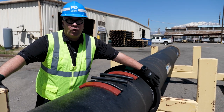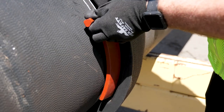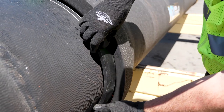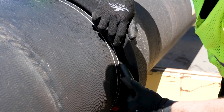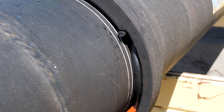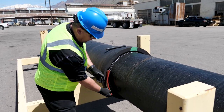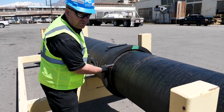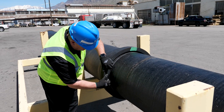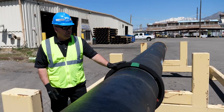Now we're going to assemble our joint. We're going to use these locking segments to form one half of the ring in this slot, and these locking segments to form the other half of the ring in the other slot. First, insert the right-hand lock, then insert the left-hand lock. Insert the rubber piece in a U-shape form. Go with the left-hand lock into the slot, slide it down, insert the right-hand lock, slide it up. Notice if you let go, gravity takes over and it falls down. Hold it back up in place, take the rubber piece, put it in a U-shape, and push it in to keep the locks separated. We now have a fully restrained joint.